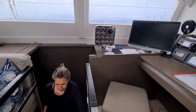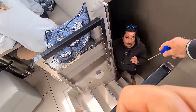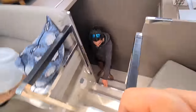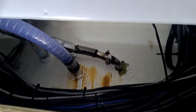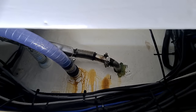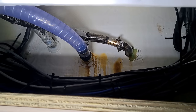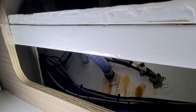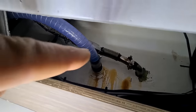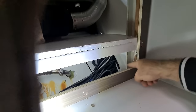It's also damaged areas of the boat. Now we know why that whole plywood floor down there is totally sopping - that's going to pack up. That foam they've got in there is all moldy and permanently wet. Three diesel heater exhaust installations all causing absolute mayhem. We don't know how far up the water's going, but there's enough pressure that at that first join it's running out, rusting on the inside, then running into the electrical system on that side and dropping down into the bilge. All these wires are wet.